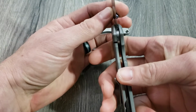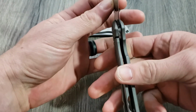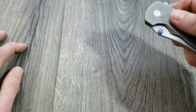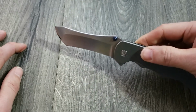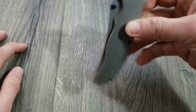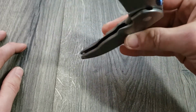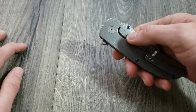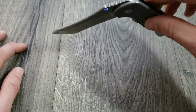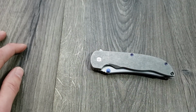Hear that? It's like a solid thwack. That's kind of the famous Sebenza vault-like lock. So don't expect that on the Norseman, but that is part of what makes this action and closing so beautiful, is that the lockup, that lock bar, is not pressing super hard on the blade, so it's able to fall freely with very little friction.